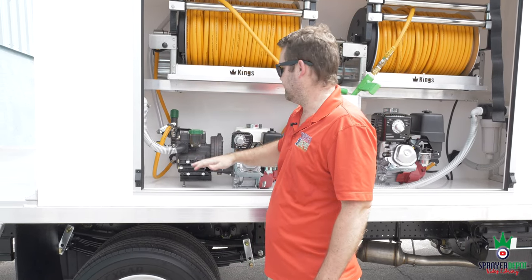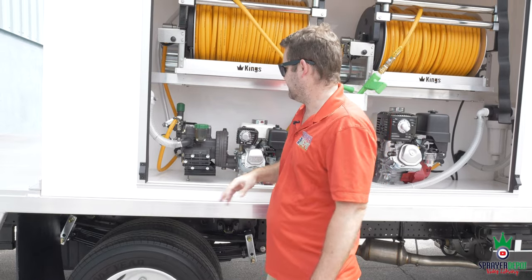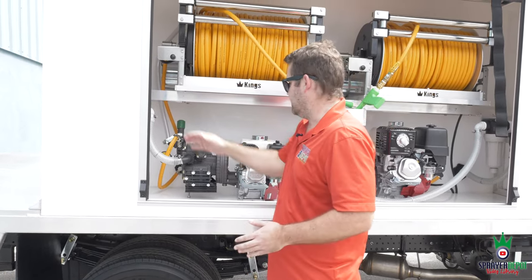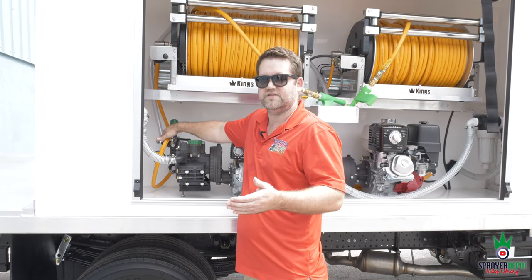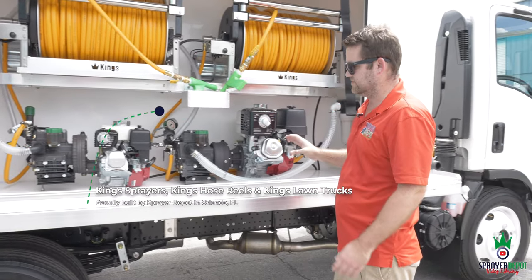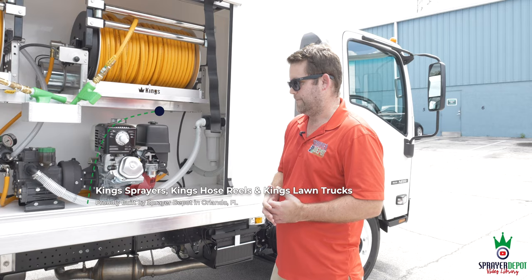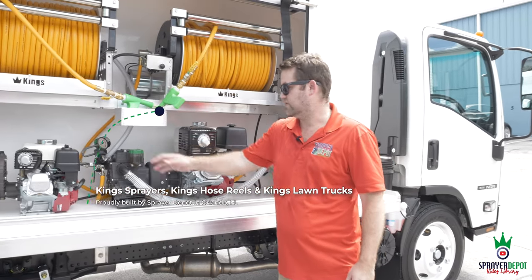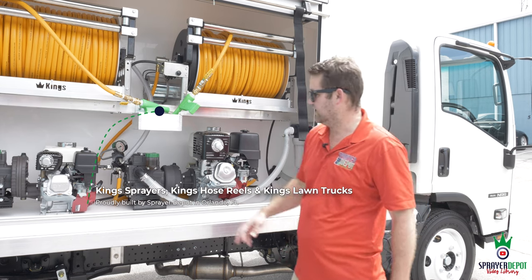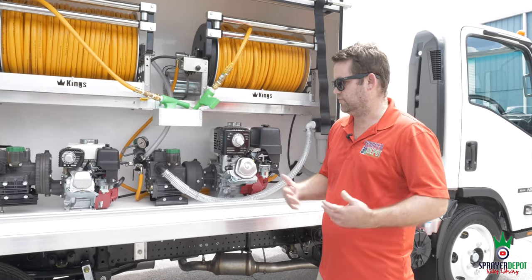When you're done, make sure you go back to bypass mode so pressure isn't trapped. Before you start the engine each day, look at two things: your sight glass — is it milky? — and your regulator — is it in bypass mode? If the sight glass is milky, don't use it. If the regulator is in up/pressure mode, find the operator and say: 'You have to put this back in bypass before shutting the engine off, or we'll be buying a new pump.' Once you know how to use these systems, they're easy.